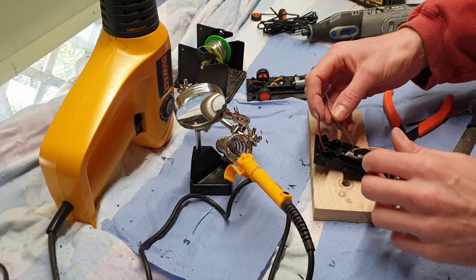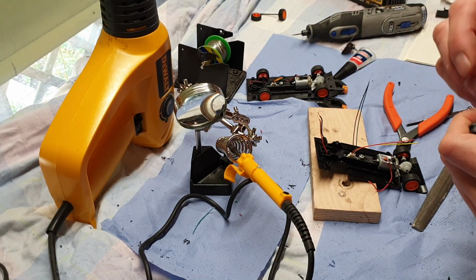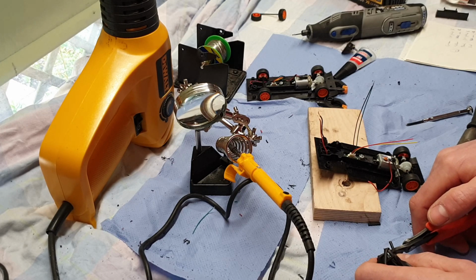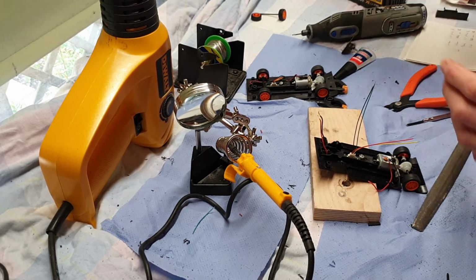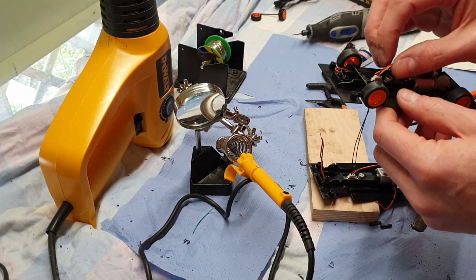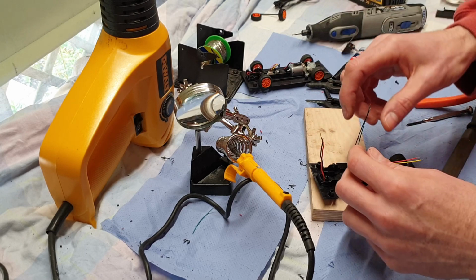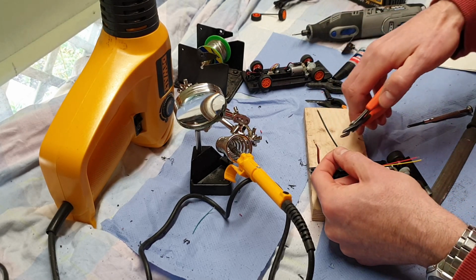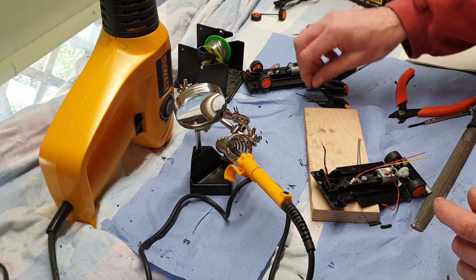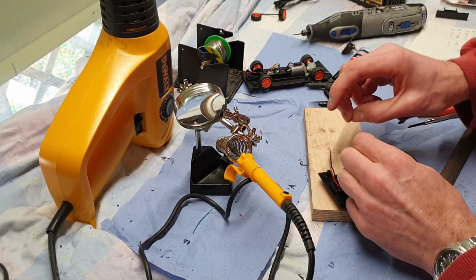The other thing you need to do is cut a couple of little bits of heat shrink. I'm just using this, I think it's 2mm. You want about a centimetre, 1 and 2, there we go. You need to leave enough wiring on there so that when you change the chip you can pull the chip out, but you don't need to leave loads on. So I'm going to cut about 5 centimetres off, so my wiring harness is about 5-6 centimetres long. Get rid of those and chuck them away because you'll never use those again. Again, trim the wires using your fingers.